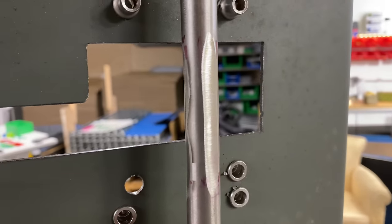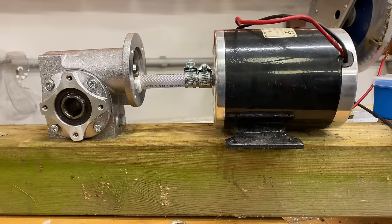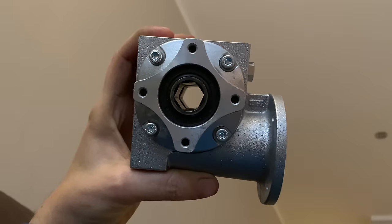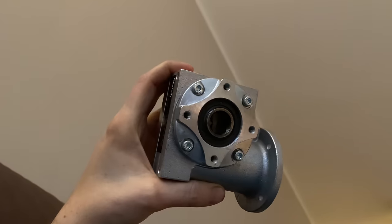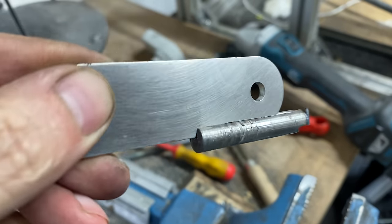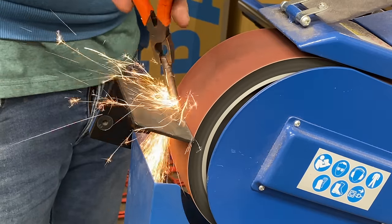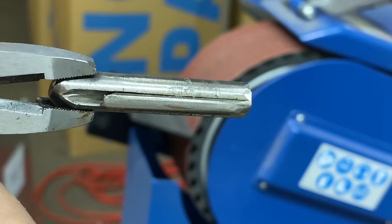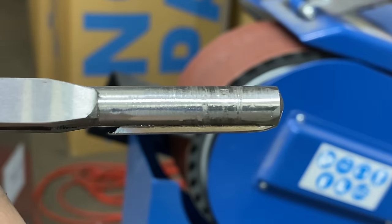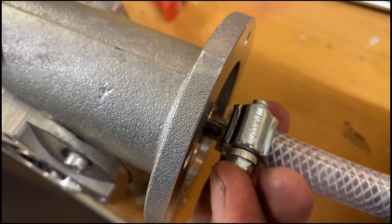I made the bar a little bit flat for the grub screws to hold onto, which worked quite well. This is a new motor — much more powerful than a windshield wiper motor — with an awesome industrial gearbox that has a hex key and a 15-to-1 reduction, so much more torque. I made a little key for it by cutting a groove with the angle grinder and super gluing a piece of steel in, and it fits perfectly into the gearbox.